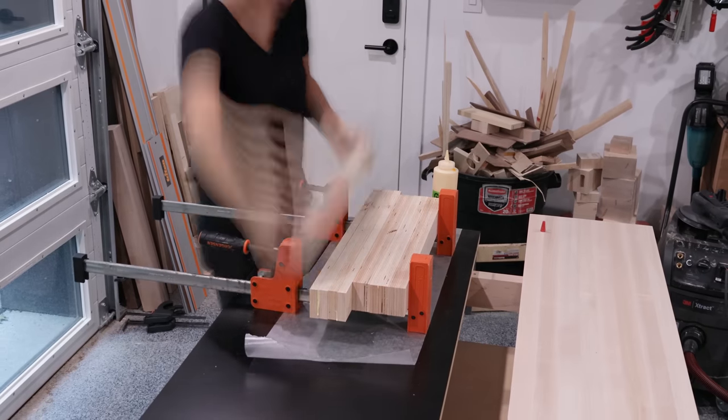I won't bore you with all this boring, but it's pretty repetitive. I remove the included bolts because they'll get in the way of my router base, but you don't need them anymore after this anyway. After you drill your first set of holes, you're going to use those holes to get the next set in the perfect spot. When you use this template you end up with three-quarter inch holes, and on the jig itself there are actually two rows of three-quarter inch holes. To move to the next set, you put a three-quarter inch dowel or dog in the hole on the jig that goes right into the three-quarter inch hole you just made. This is just so easy to quickly place down and keep drilling accurately spaced dog holes.